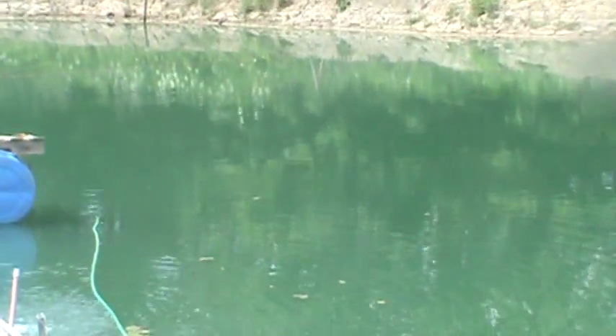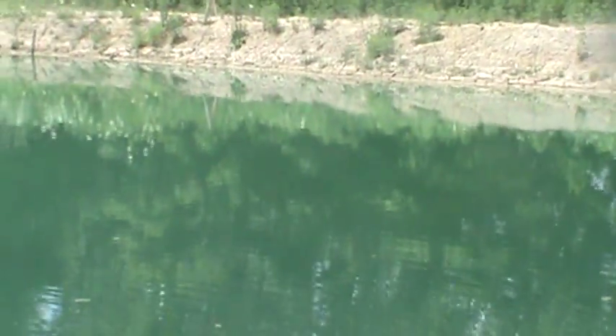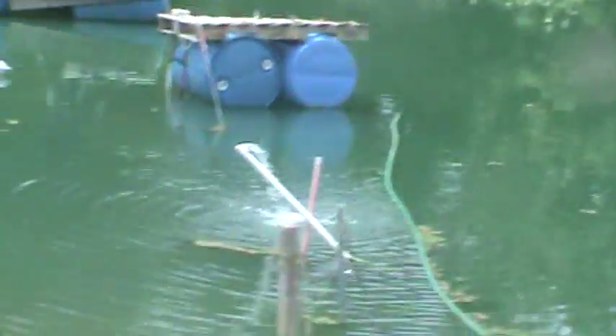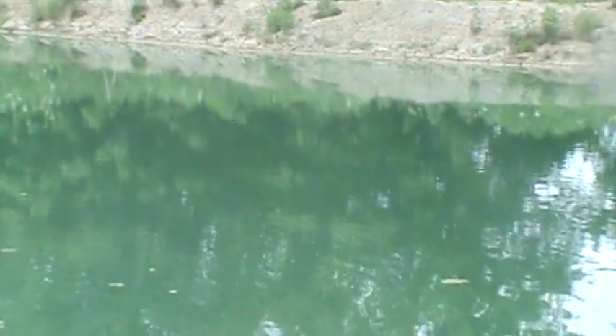I have a regenerative air pump — high pressure, high volume also — hooked up through those white one-inch pipes. I hooked that up and apparently it's too deep too, because no air comes out of the air stones I've sunk out there. So the 70 liters-per-minute unit is unable to stir at the depth I have it at. I'll have to figure out what depth that is — maybe eight feet, or six, or ten. There's a spot right in the middle where it actually gets to ten feet.